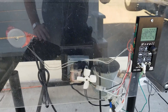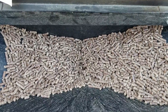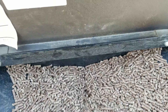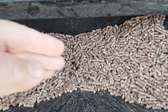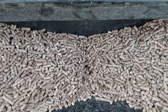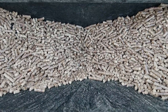You can hear it, but it's nice and quiet. Another thing I like about this — other than continuous — is having the pellet hopper vibrator run when the auger runs helps fill in any gaps that might be in the auger. You get an auger full of pellets every time it drops instead of holes here and there.